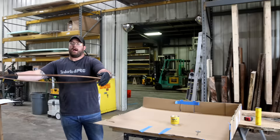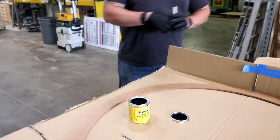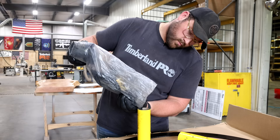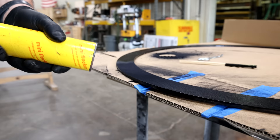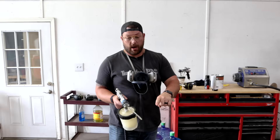Now it's time for some fun stuff. This is an insert where a bunch of challenge coins are going to sit. We're going to make it felty with flocking — we've done this before on the jewelry box and some other projects. You got some pretty stinky, sticky stuff here, so make sure your room is ventilated. First we'll apply it and try to hit the outside first, more or less get a coating on the whole thing. Then the fun part — this is a mini flocker. You fill it with these fibers, hit the outside and let it overspray. We'll let this sit overnight and shake it off in the morning. It looks super weird, so I'm going to hit it with a couple coats of lacquer to make it really pop.